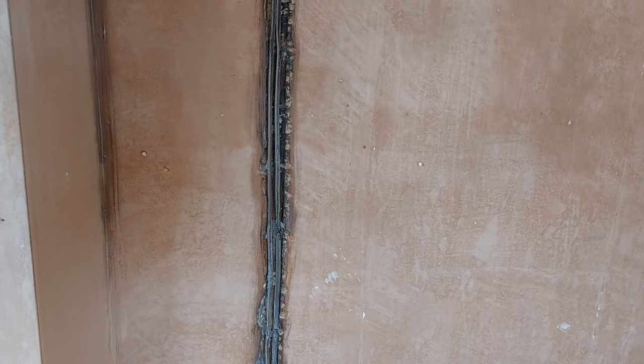Right, let's mix some bonding. I've not had a quick haircut. This is horsehair. Now, we won't be using horsehair in our backing coat for this particular project. Reason being, it doesn't require it because it's a modern gypsum-based plaster. However, if I was doing it with lime, I'd be using the horsehair in the mixture to basically strengthen it.